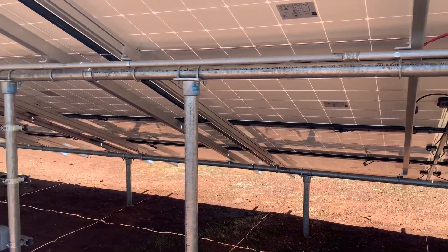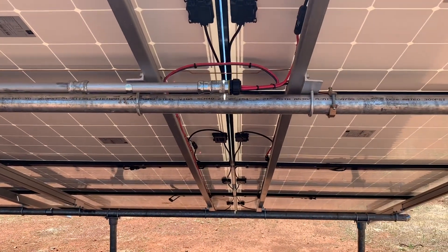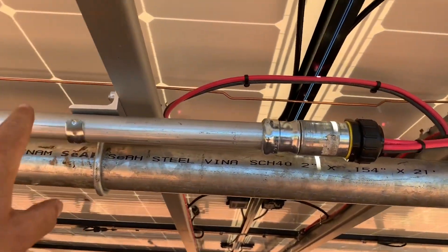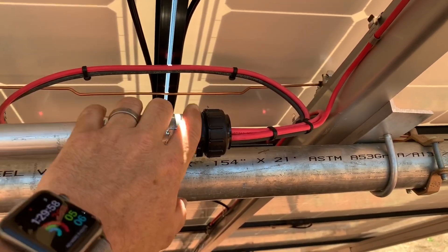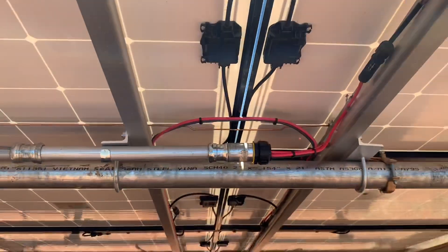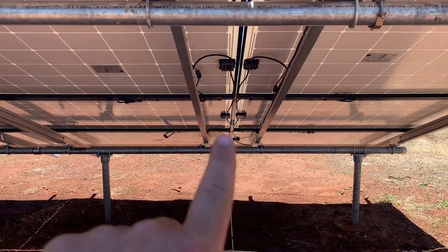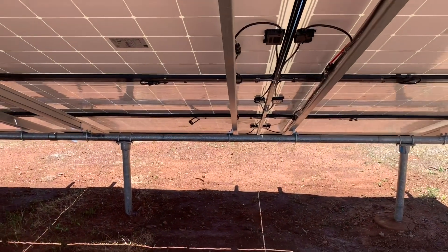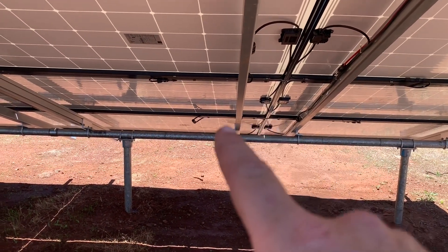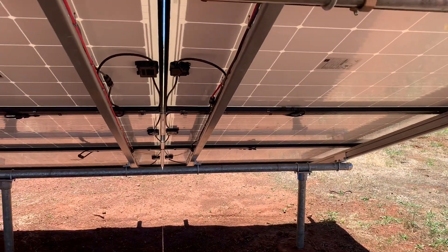All the wiring was done in EMT conduit. I know it could just be zip tied to the rails — that's standard practice for a lot of people — but I prefer to do it this way because I can bend pipe. The EMT comes in and then we switch it off to a Paco gland and kick all the PV wires out of it. I feel that when I build these systems, one of the main things I'm going for is keeping everything tight and clean. I think somehow I got two batches of panels because some of the wires were a little different configuration in how they wired up.